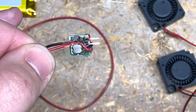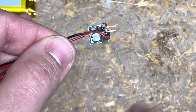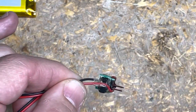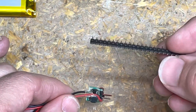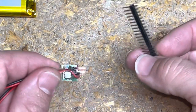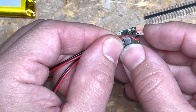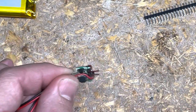What I've done differently now — let me zoom in — instead of having wires coming off in multiple directions, I put a 90-degree angle pin header on here. These come in breadboard accessory kits for general electronics. I soldered them into the board, and these go directly to the fan. I use this specifically for the fan because the fan's plug holes are actually larger.